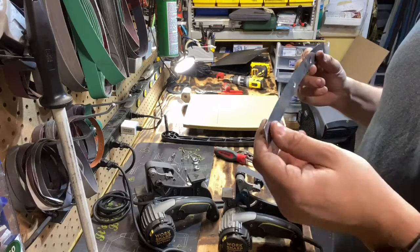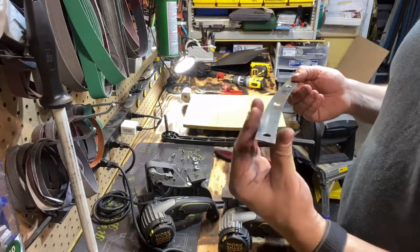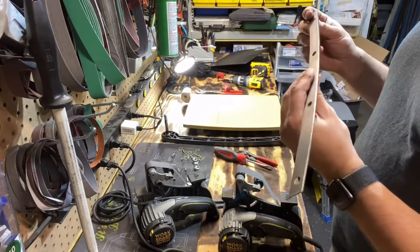It's the same for knife sharpening. You're running it until you can feel that that burr is there. That means that you've reached the edge of it, and it's starting to push that material over onto the other side. And that lets you know that you've reached that side. You're done with that side.